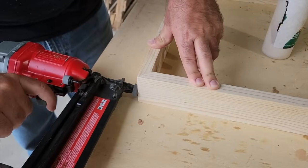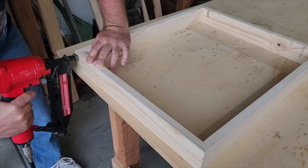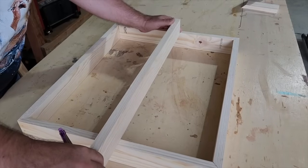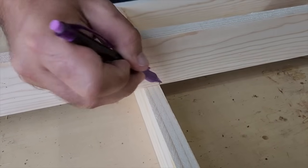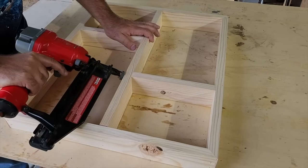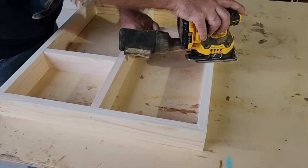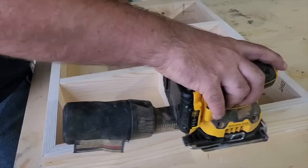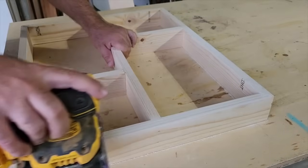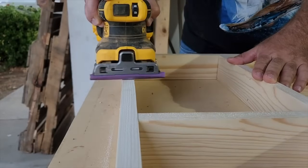Use the nail gun on all the corners — two or three nails into each side. Once you get it together and the glue dries, it's going to be super strong. Now it's time to put some shelves in — I want to put one piece right up the middle, cut it, put it in, and then build two little shelves, holding them together with brad nails. We're going to go ahead and sand it. Sanding helps the stain penetrate the wood and gets rid of any lettering on the board. This is a one-by-three, so the painting won't stick out too far from the wall.